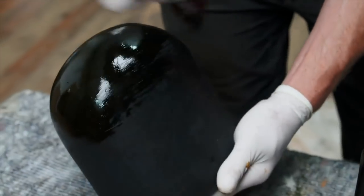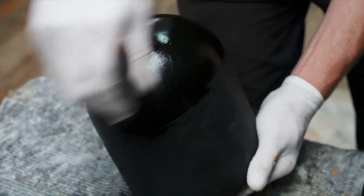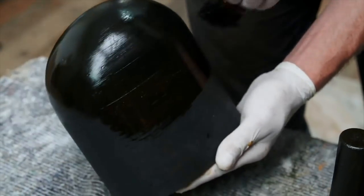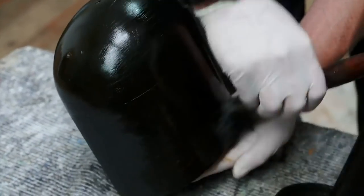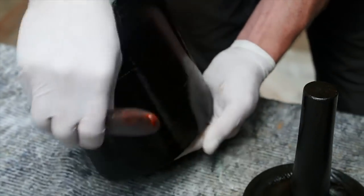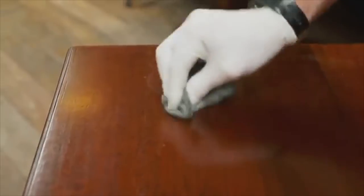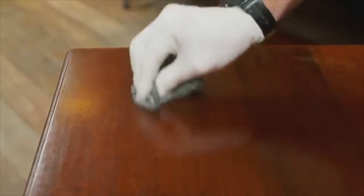As soon as you've applied it and got a nice even spread, you can't go back to that area for about 10 minutes — otherwise it will dilute itself again and strip itself back off. So the important thing is to get your spread as quick as possible and then just let it dry. We'll leave this to harden for about half an hour and then apply a second coat, and I think then we'll have the perfect finish. By rubbing this, we won't damage the surface or take it off — we'll just burnish the mark and hopefully reduce it, ready for polishing up the finish.